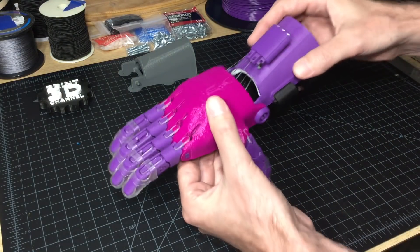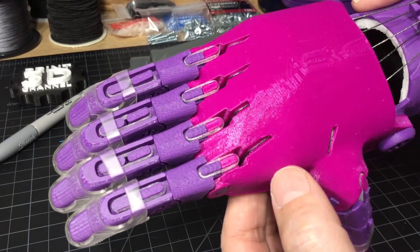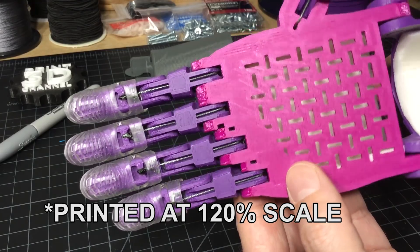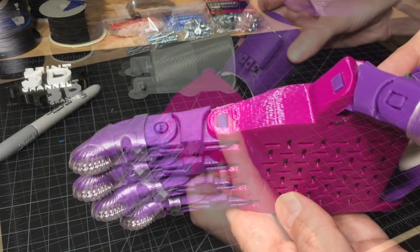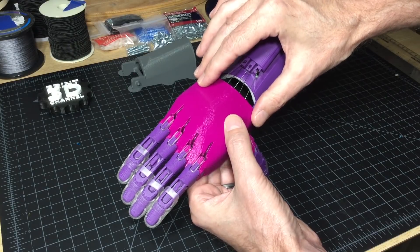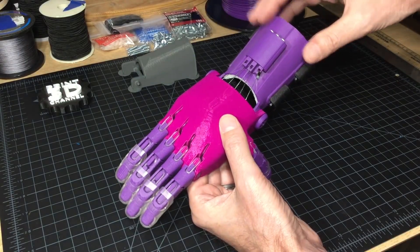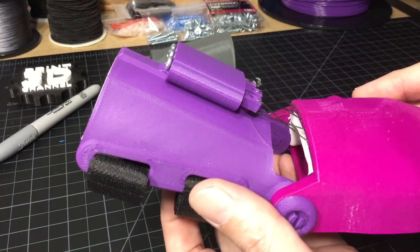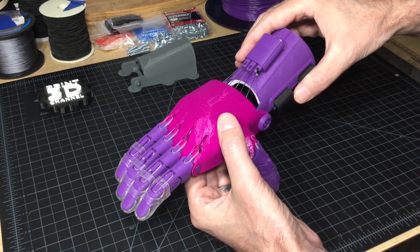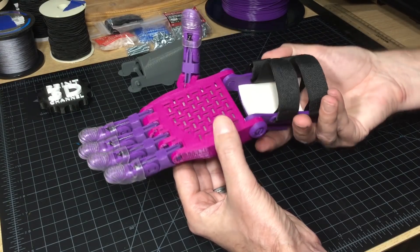Let's review the print quality of the Phoenix Unlimited hand that we are submitting for approval. All the parts are printed with the requested settings on the Enable the Future website on the GMAX 1.5 XT Plus. We used two different types of materials from MakeShaper: PLA PHA, which is a co-polyester blend, for all the fuchsia parts, and their standard purple PLA for everything else including the gauntlet, the tensioner block, and all the additional parts. The print quality is quite excellent — we didn't use any support material and it didn't require any cleanup.